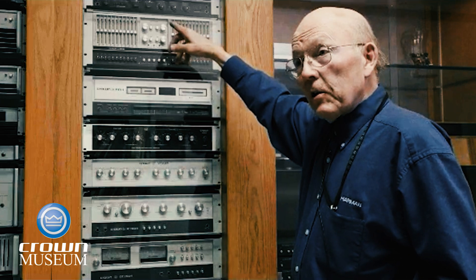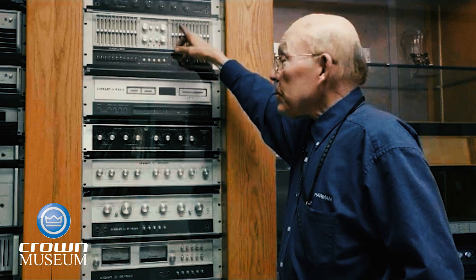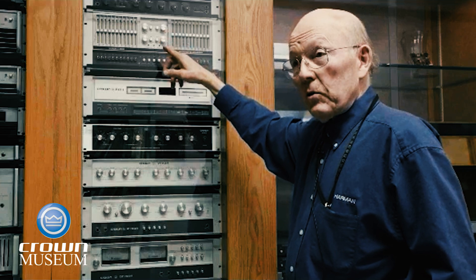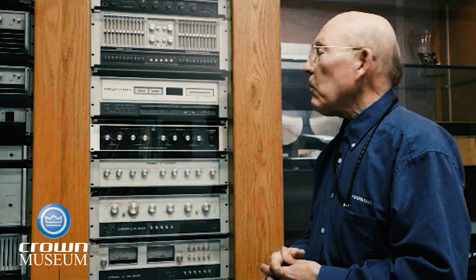You see gold contacts — the mechanism is all custom. We tooled up all the sliders used in there and the circuit board behind. It's all custom. It's got a separate set of EQ features here: shelving EQ. We recognize that in most systems you're really wasting a whole bunch of filters if you use a whole group of filters to create a shelf. Why not just put in shelving as a separate feature and start doing your higher Q tuning with these once the shelving is done? So that's novel too — to see those two forms of equalizers cascaded in the same box. It was really a different look at equalizers and what we thought people actually needed to do.